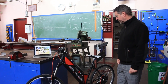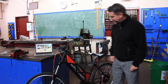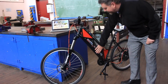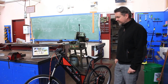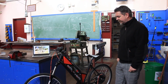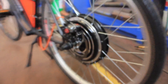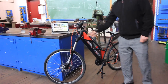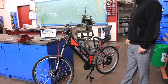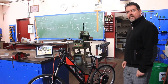This bike deals with a few of the issues required by an electric bike really nicely. Great weight distribution — the batteries are central and low, so the bike balances really nicely. I've ridden it; it's comfortable, predictable, and feels very safe. Disc brakes were a great choice in componentry, providing good stopping power given the weight of the batteries. Suspension makes the bike comfortable. Overall, it deals with quite a few of the key issues really nicely.